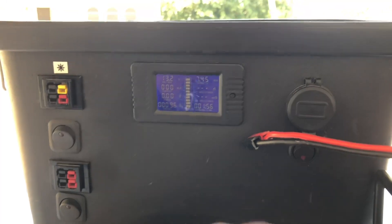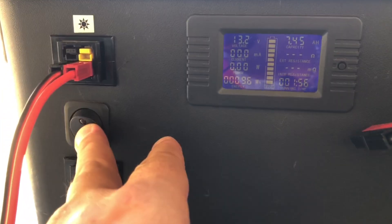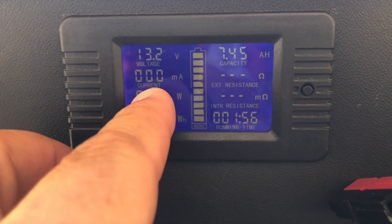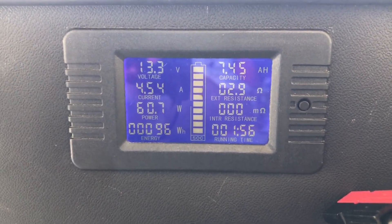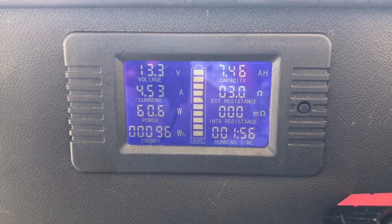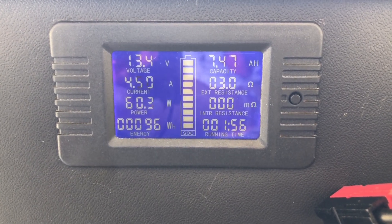The first thing I want to do is check the MPPT controller. I'll plug it into this port here, and once I flip this switch that'll turn the system on. We can see the voltage here — that should start going up. We see the amps in milliamps or amps depending on level, and we can see the wattage. Let's flip the switch. Our voltage is now at 13.3 volts, we're getting about 4.5 amps, 60 watts. Now 13.4 volts — it's doing the thing.